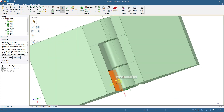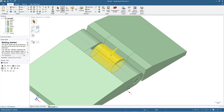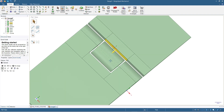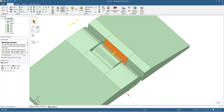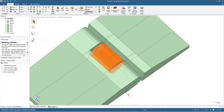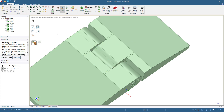I do the same with the other cylinder — still in project mode, so just press Enter. Then I click select to escape the project mode. Now I will pull the left leaf to the cylinder to make a knuckle: click the surface, click pull, press U or click 'up to', and click the cylinder. Same thing for the other one — click here, press U or 'up to', and click. Now these two knuckles are connected to the left leaf.